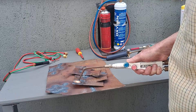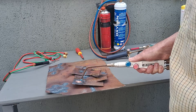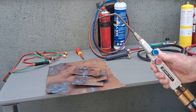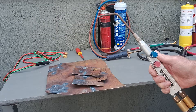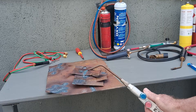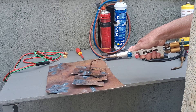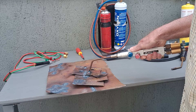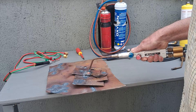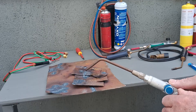It goes orange-white, white-hot straight away, and you can melt through that — you can weld with that easily, which I have done. Beautiful flame. It's a cleaner burn than the acetylene — you can barely see it. You can see the heat it gives out. That's lovely. So that's the big propane bottle and the pure oxygen from the cylinder.